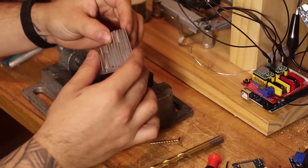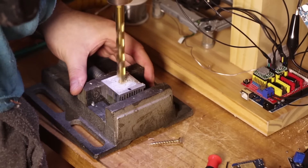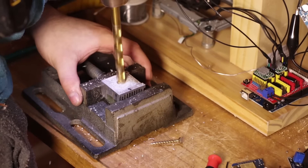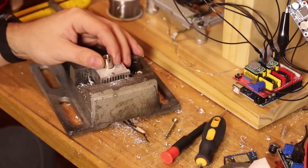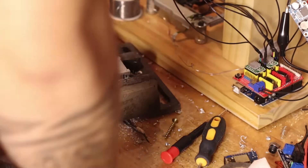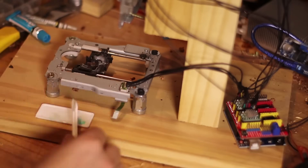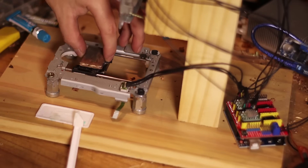For the laser, I grabbed a little heat sink, made a hole in it, and put the laser module inside. This wasn't strictly necessary, but as it heated up a little, I wanted it to be more cooled. Once you make the hole, stick it in with thermal paste for better heat transfer. With epoxy putty, I stuck a little piece of iron underneath so that everything is leveled.